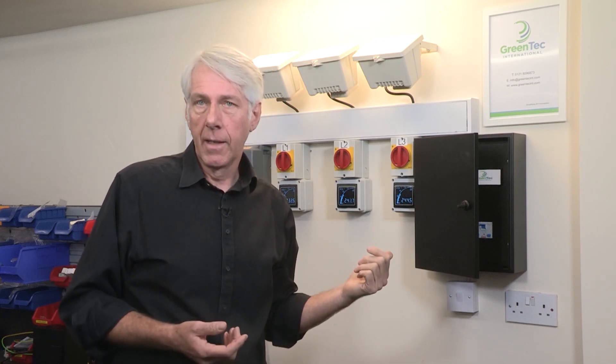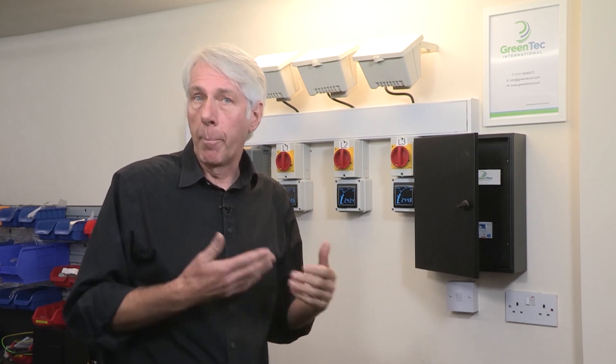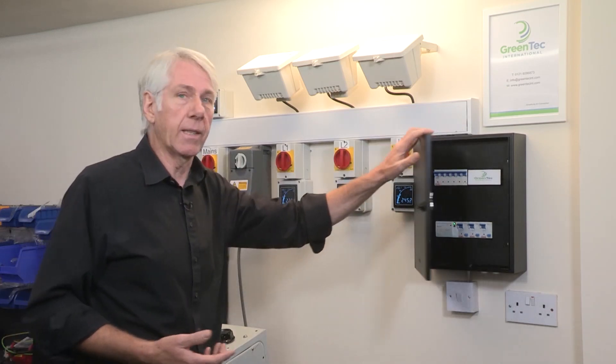However, if the supply becomes unbalanced — for example, by switching off one of these lights — we'll see that if the voltage between protective earth and the simulated earth rises above 70 volts for a duration of not less than four seconds but no longer than five, the open device will trigger a shunt within the control box that will disconnect all three phases and protective earth.